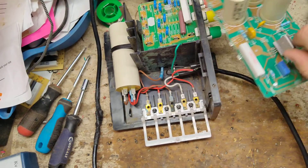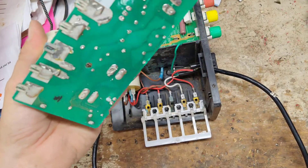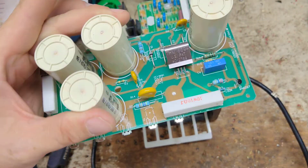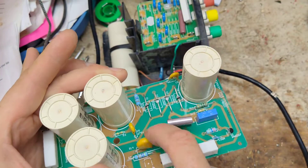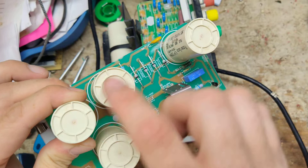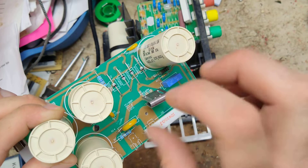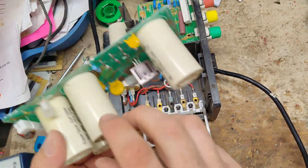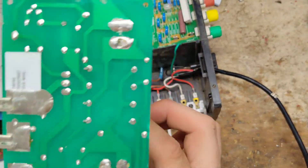So our issue is with this board. Gallagher themselves no longer make this board new — they discontinued it sometime in 2020 or 2021. But these are old school, and everything on there can be replaced if you know what you're doing. You can get SCRs, diodes, MOV varistors, capacitors. You can't get this exact style anymore, but there are other capacitors that will fit on this board — a square rectangular shape, a little wider — and you drill holes and use jumper wires to the solder joints. I've done it a dozen times.